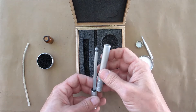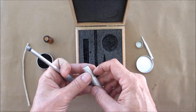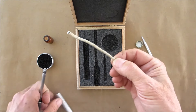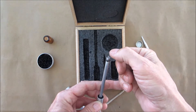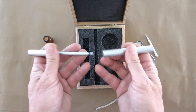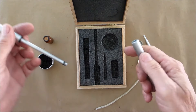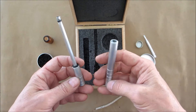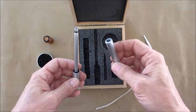You want the bottom end of the piston not to hit the bottom of the hole. I measured down with a stick and when I made this I made sure I had about an eighth of an inch from the bottom, because you want the fire and flames to be able to go over the end and touch the char cloth. If the piston bottomed out, there's a good chance you won't be able to burn the char cloth. If you have any questions, leave me a comment or send a message and I'll do my best to answer.